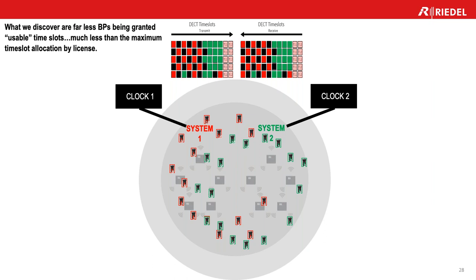It's the fact that you've assigned an ID to it and given it a personality that's tracked back to the artist frame. And also, as an antenna group, you have taken a digital picture of that belt pack, memorized its hardware ID, and assigned an assignment number to it in the first place. So if it doesn't recognize the hardware, the antenna group won't do anything with it, which is kind of the safety mode. On top of that, the audio transport is encrypted, so it won't connect to it audibly, and it won't unencrypt the audio, even if it somehow could.